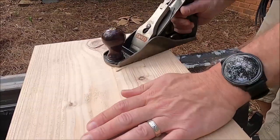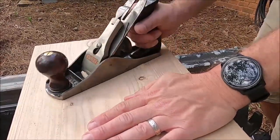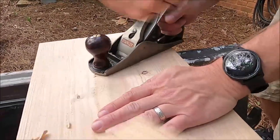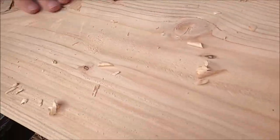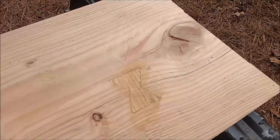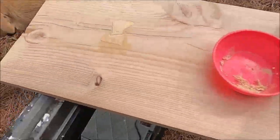I like to just cut them loose after the fact. You can also take a hand plane to fine-tune it or just sand it down, whichever route you prefer. Then I filled the cracks with sawdust and wood glue off camera.